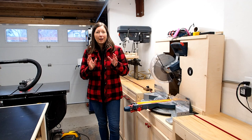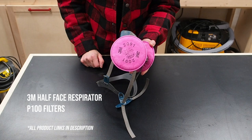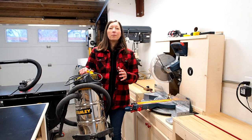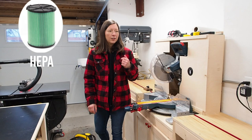At a minimum, I recommend having a respirator with P100 filters that fits tightly on your face. There are different sizes, and I'd recommend using one even if you don't have any dust collection in your shop — and even if you do, I still wear mine. For more recent or advanced shop vacs, you can swap out the filters for a HEPA filter, which will dramatically reduce the spitting out of fine dust.